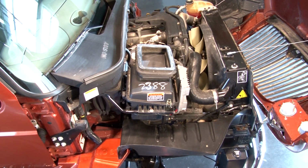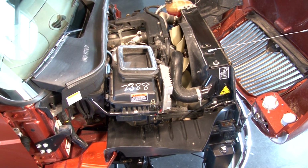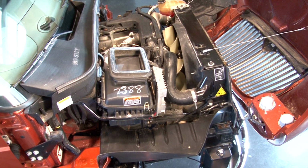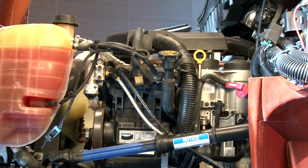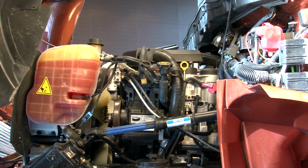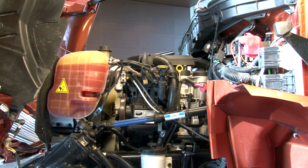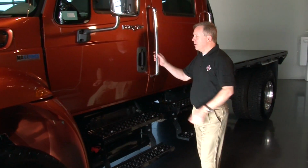Finally, make sure you look at the engine as a whole. Look for leaks or hoses that are loose or cracked. Once again, it's better to catch a problem early and have it fixed than incur towing or road calls, not to mention the added cost of progressive damage to the engine. Remember, clean, fresh fluids filled to the proper level are critical. So if the fluids are leaking out of a hose, the engine might be seriously damaged. Now let's move inside the cab.